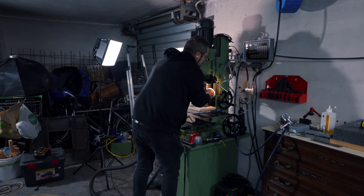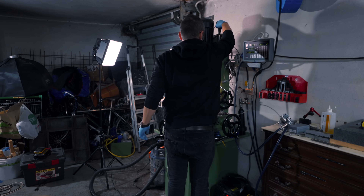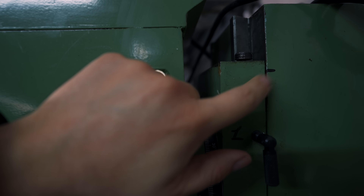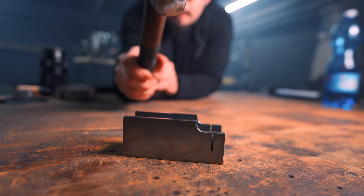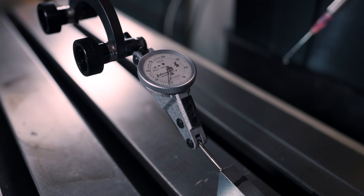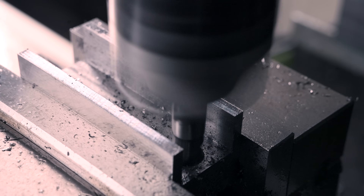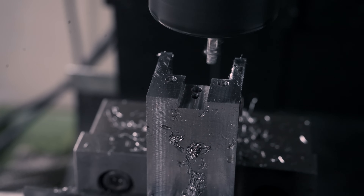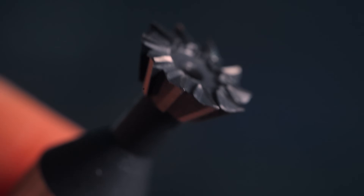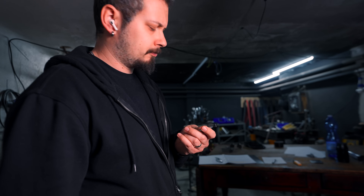But I foresee a complete teardown of this machine in the future to fix some deep structural problems, because when the gib is tightened properly, the head binds past this point. I'm still an idiot, because now the part is crap and I can't blame it on the machine. At that point I had no choice but to hit the base with a reset hammer and start over. But on a positive note, with the machine tight and trammed once again, remaking the base feels really good as things finally come together according to the print. The next operation is to cut my very first dovetail, but I'd like a tight fit, so it would be nice to have the mating dovetail at hand — which means I need to make the bumper first.